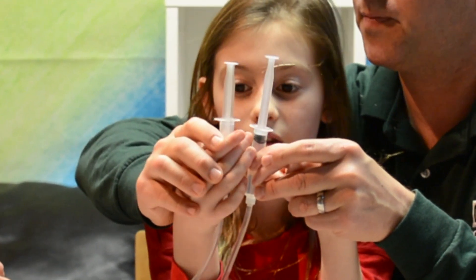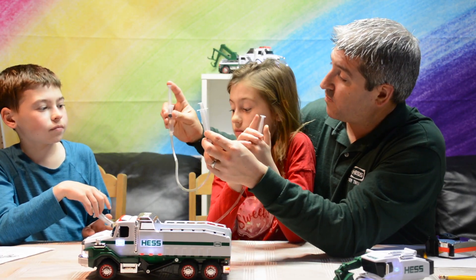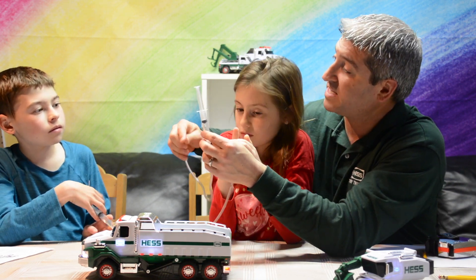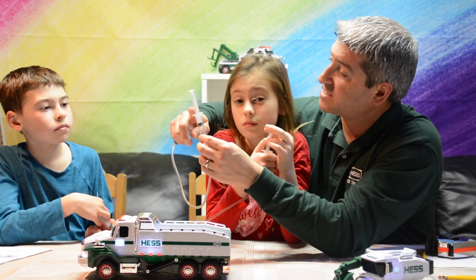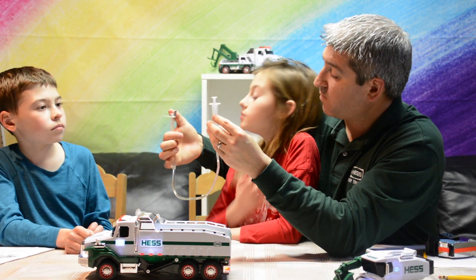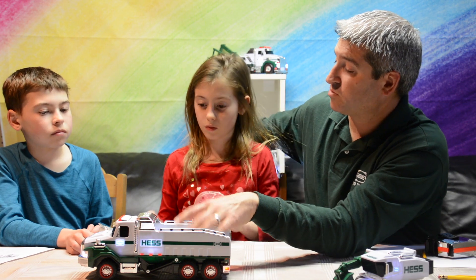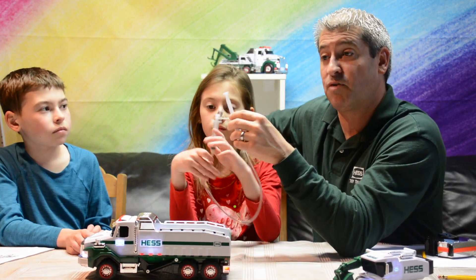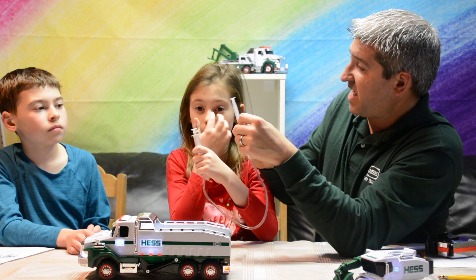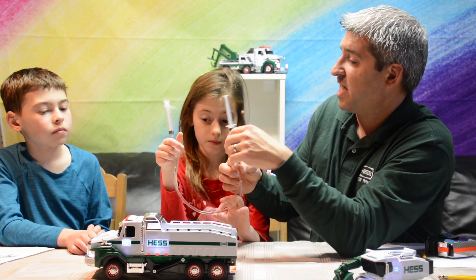Let's explain what's happening with the air one: when you press, the air first gets compressed, it builds up pressure, and heat gets released because the air gets compressed — so energy is lost in the process and it doesn't go up as hard. With water, when you press, it immediately transfers into the other piston and pushes with huge force — there's no loss because there's no real air. Real dump trucks use a special fluid that can withstand a ton of pressure and heat, so it exerts all of its force in the lift.